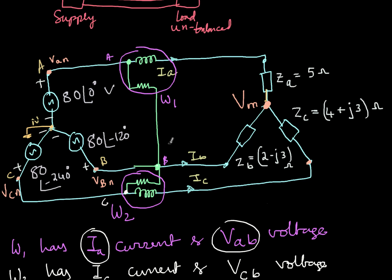Now if I run the code, now you see W1 is coming correctly, 977.38, but W2 is 3958 and the total power is 4936, which doesn't mean anything. See, it's like some kind of double counting of watts is happening because of this wrong connection. So this is wrong connection giving PT as 4936. So what is the proper connection? Is that current coils in two of the phases and the pressure coils of the two should be connected to the other phase. Anything you can select.